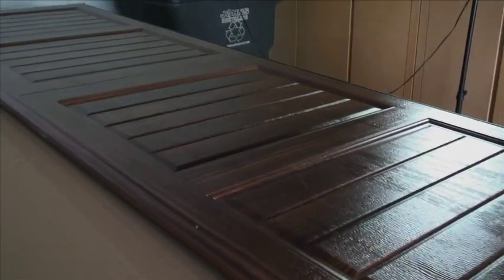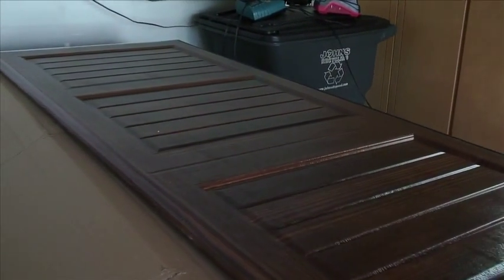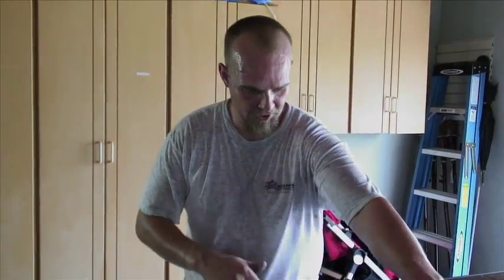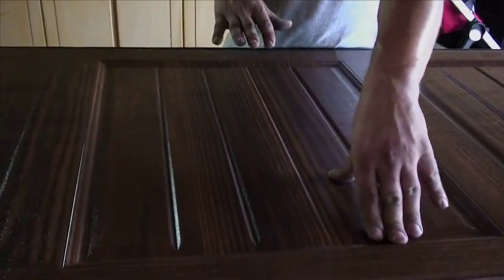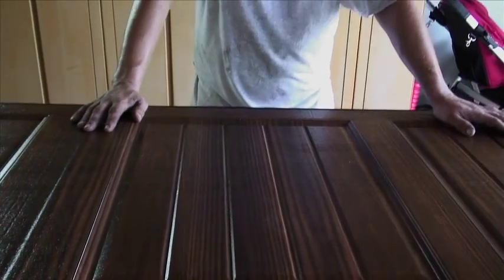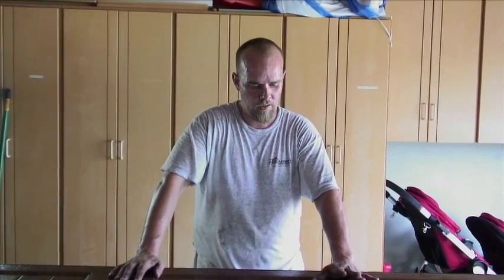It's completely unique to Amarr that it's a 3-section door, so the door is a lot less busy and you get a lot more glass. It's not for everybody due to the glass, because with the other panels this is all going to be glass, which with most doors you get like a 16-inch section of glass. You don't get a full one. This is a 28-inch section. And they also come in a 32-inch section depending on the size of the door. If this would have been a 16 by 8, this would have been a 32-inch section instead of a 28.